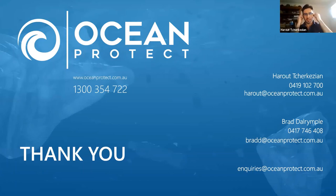if I go back to that example I think I gave with the 690 cartridge. From the top of the false floor, as water starts building up, that float's going to sit in its original position until water gets 690 millimetres high. So essentially to the top of the actual cartridge, to the shoulder of the cartridge, is close enough. Essentially that's where the air valve is. That's where the top of the float's going to lift.